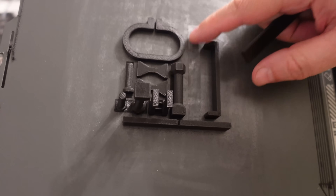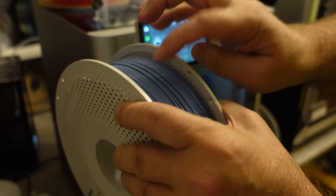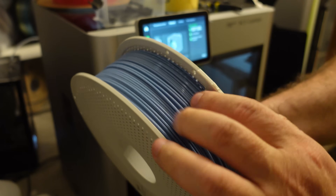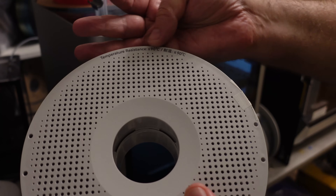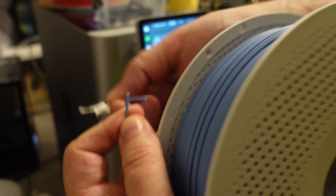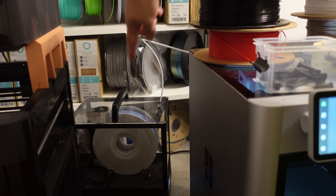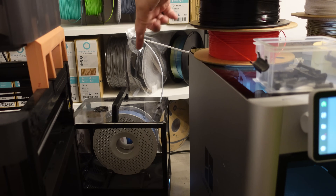I think glue is needed here as a separation layer. Wow, this glass fiber looks really nice in this blue color. It is also on a 90 degree Celsius spool. Let's see how brittle this filament is — same as the carbon fiber, very brittle. It also goes to the filament dryer for one hour and then I will start printing.